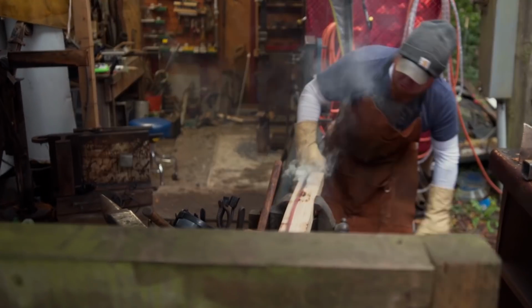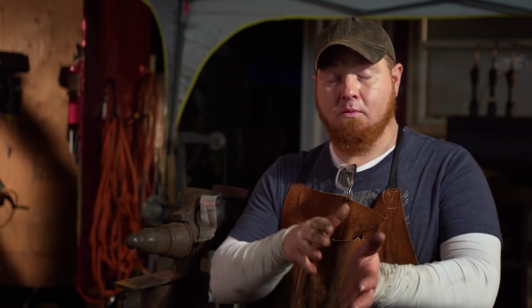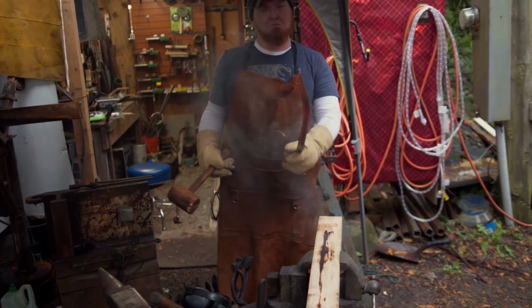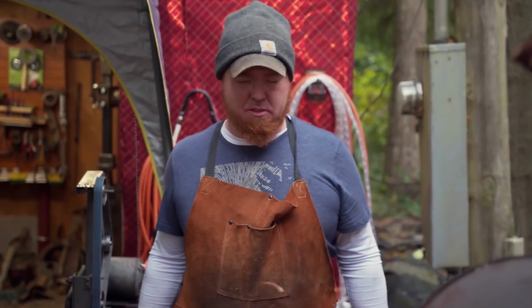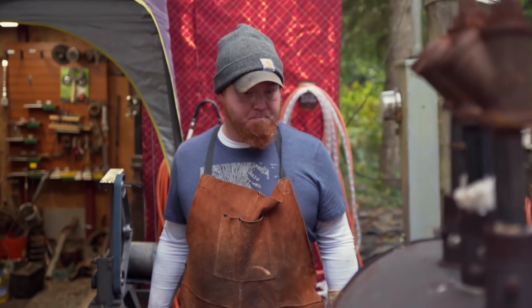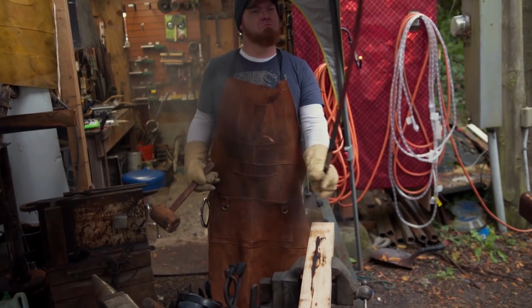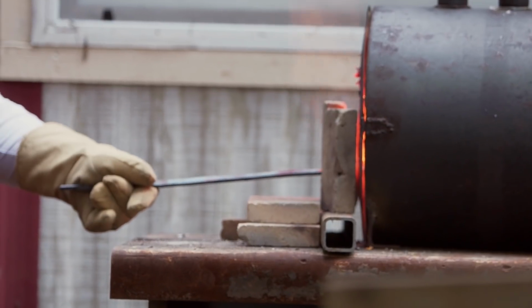I'm looking down at the blade, and I see there are 2 complex bends in this. One is twisting to the left, one is twisting to the right, and the one that's twisting to the right is actually sitting right where the tang meets the blade itself in a very critical juncture. Not what I want to do right now. This is gonna start adding time that I don't have. It is slowly coming out as I'm tapping on it and working it back and forth, back and forth. Very nice. Complete sigh of relief.